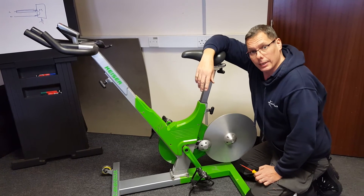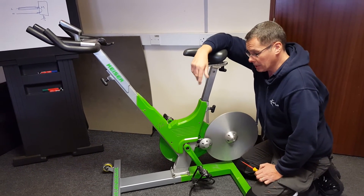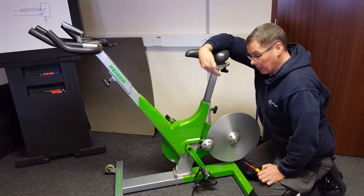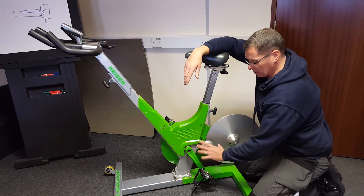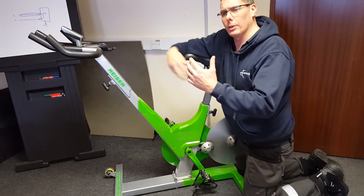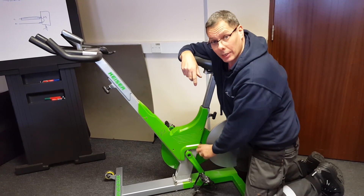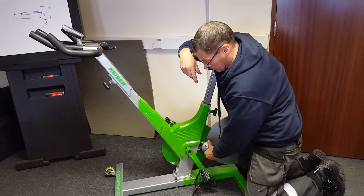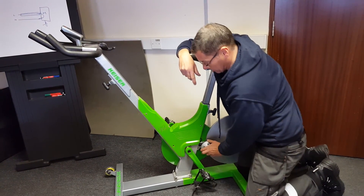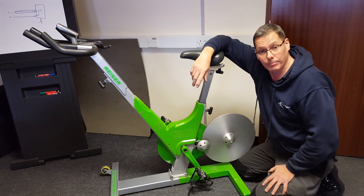The system is really easy. I think part of the difficulty with recalibrating these bikes is that, without knowing how the system works, using fancy tools and having to move things five times within five seconds makes it all seem really complicated — but it's not. All you're trying to do is synchronize that potentiometer with the travel on the spindle. Once you know that, it's a piece of cake. Hope that helps.